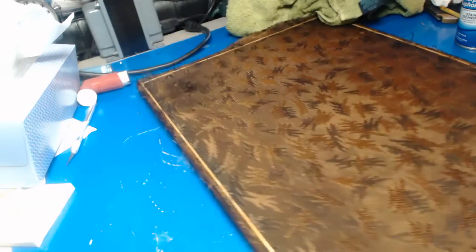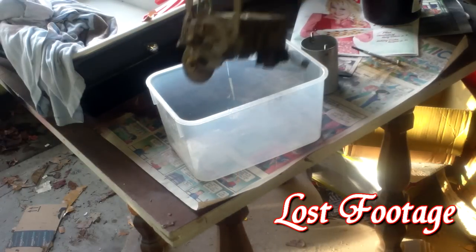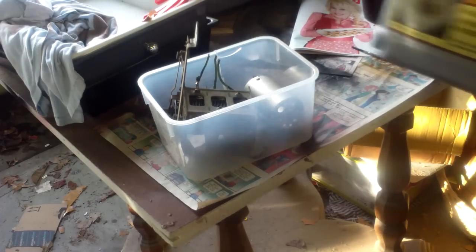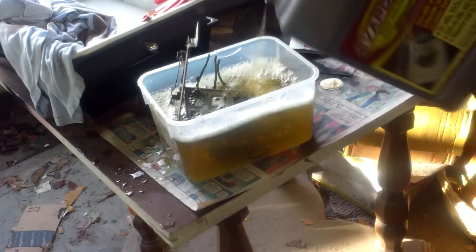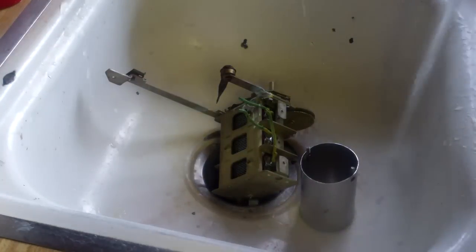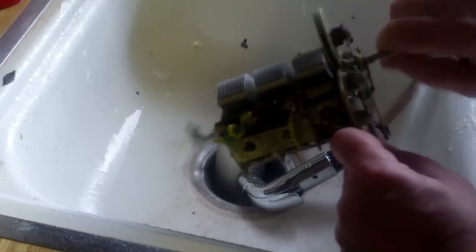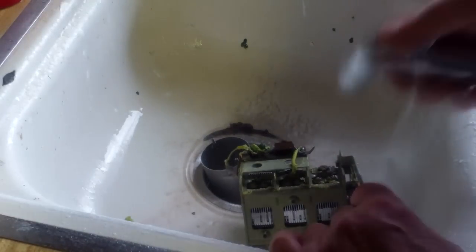It did brighten it up quite a bit. Here's some lost footage that I took last year that I forgot to put in the video. I am soaking the tuning condenser in a can of Vapor Rust. There was a little bit of rust on the tuning condenser, but it was a big mistake — as you can see, there's a greenish-yellow haze on the steel. As I was rinsing it off I looked at it and thought, man, this is gonna take a lot of work to get this crap off.